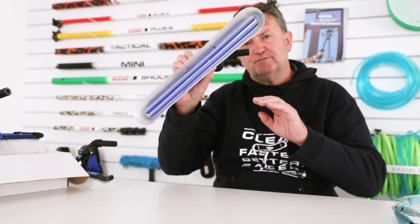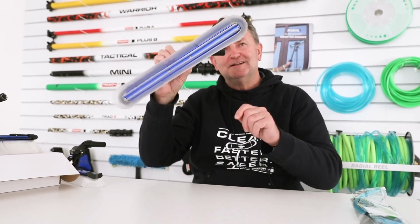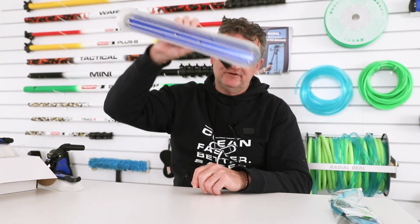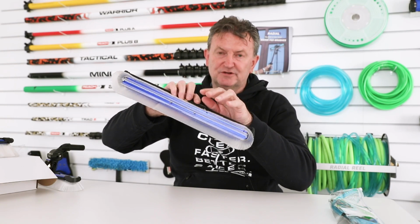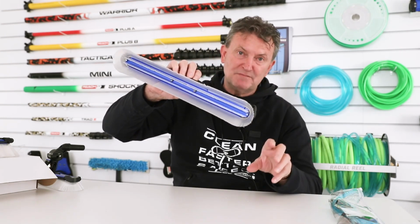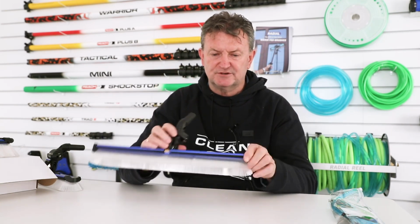So that in real terms, it's going to look like this. You're going to come across the top of the window into the corner. You're going to jiggy it in the corner. Peter Thomas calls it the jiggy. And then you're going to turn the brush to its side. The water is going to come out over the edges, so it's going to flush the corner. And then you're going to go down the side of the frame, right? And then all the water is going to come from the jets. It's going to land on the glass, fall down the glass, land on the bristles, and then it won't go through the brush. It'll run across the top of the brush, and so you get this massive flow of whatever your flow rate is, right? So basically, when you push the brush harder towards the glass, the inner bristle will agitate.